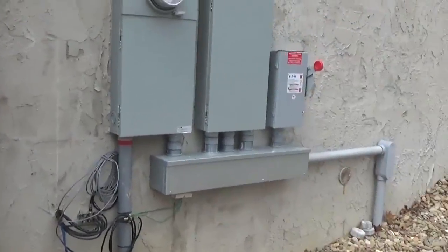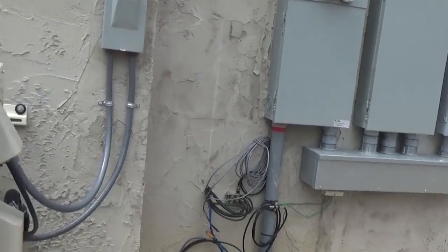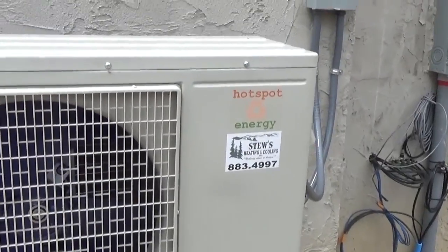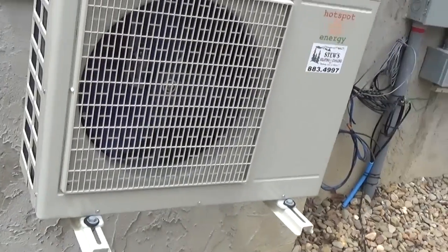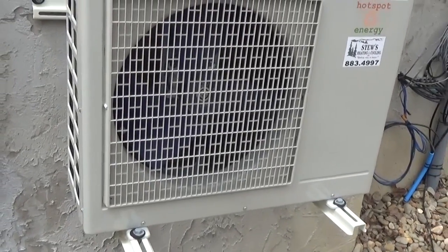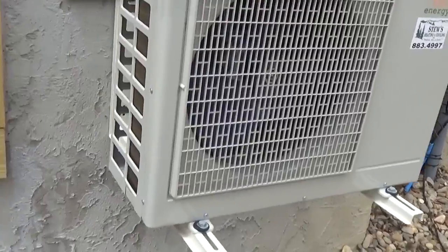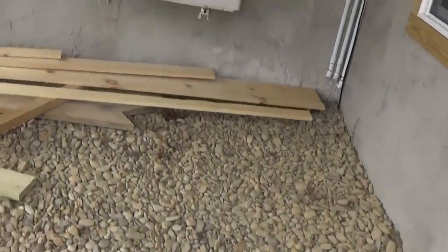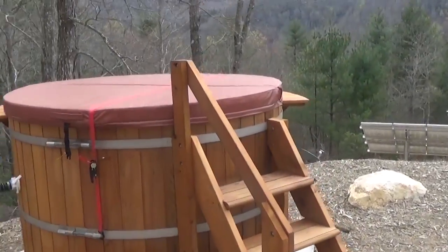The system is on and running — it's nice to come back and see something working so well. The HotSpot DC air conditioner has your outdoor unit and indoor unit. It's a 12,000 BTU or one-ton mini split heat pump that does both heating and cooling. We did the whole house with mini splits and we're able to run completely off-grid and be very comfortable. These work down below zero, so you can get your house all conditioned.